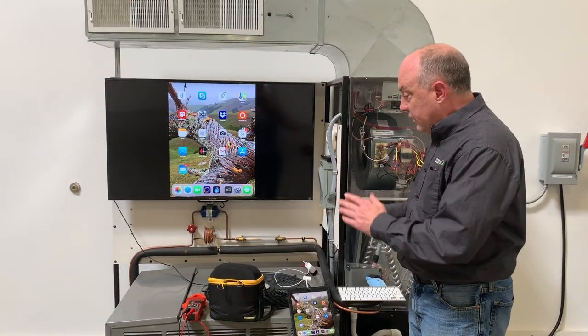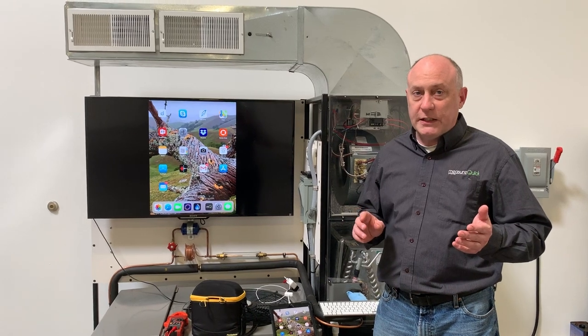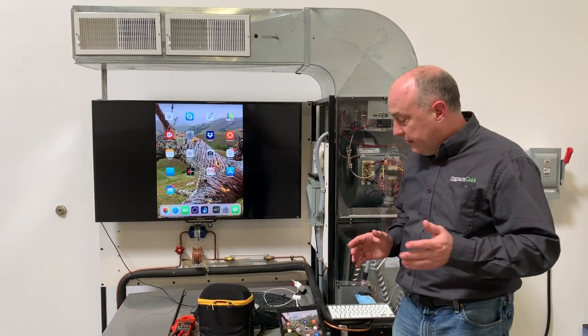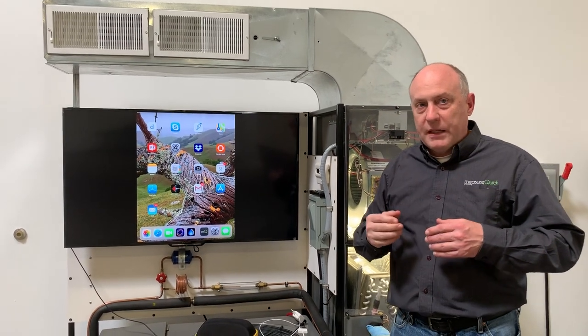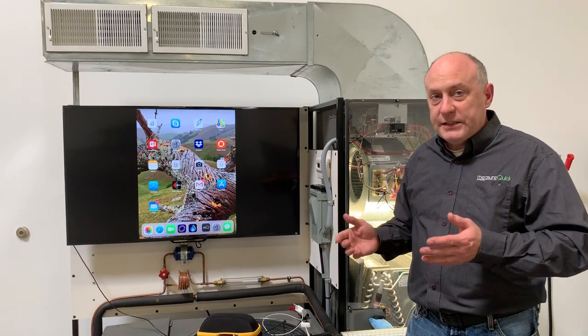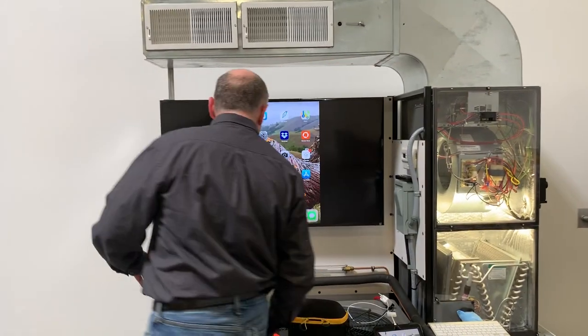What I've got set up here is just a training unit, and I realize this is going to be a little bit faster than on a residential job because we're not going inside and outside, but bear with me and you'll see how quickly you can actually get the testing done. I'm going to start the unit up first because all these units have a little bit of a time delay. That time delay is going to take a minute to satisfy, and this allows me to get a few seconds to start putting on my probes.